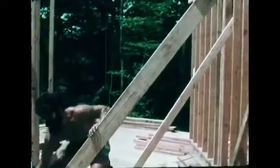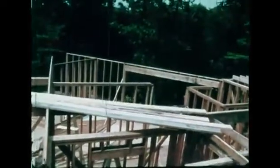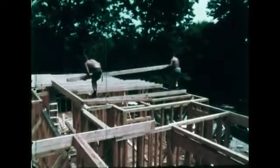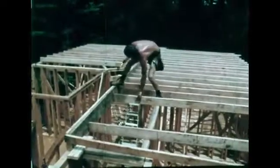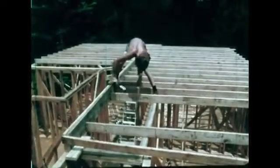When a house is designed to have more than one story, another floor deck is built on top of the walls. Since this section of the house will be only one story, these joists will support the attic floor and serve as a nailing surface for the first floor ceiling. The joists are supported by bearing partitions and exterior walls, and sometimes by ceiling girders. Nailed to girders and the top of the walls, the joists help tie the house frame together.